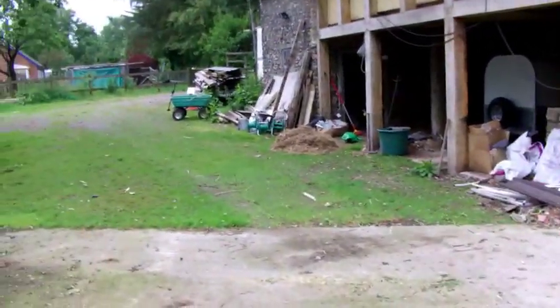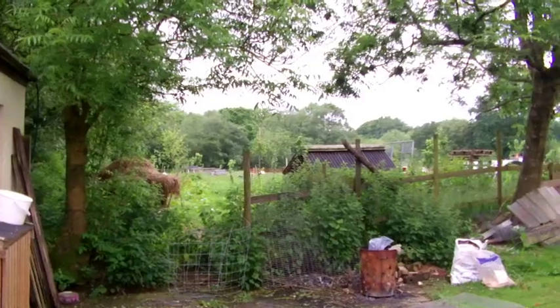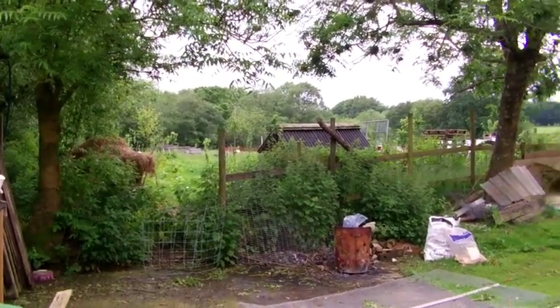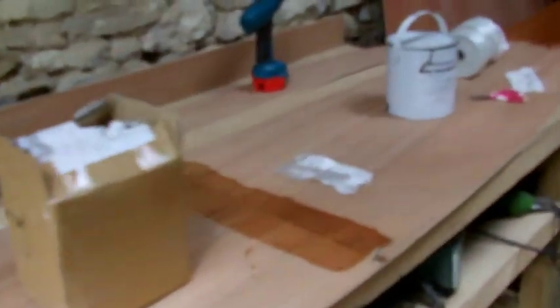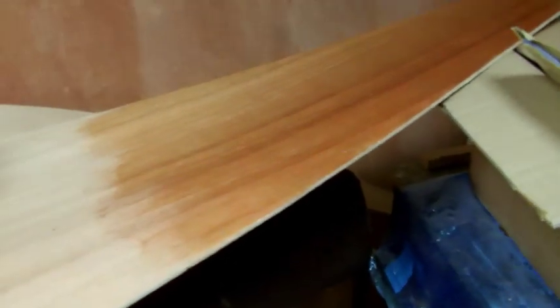It's quite a small workshop but nice, with a table saw, thicknesser, bandsaw, and mortise machine. I'll show a little video of the camp later — I'm camping in the wood for a few days to crack on with the build. If you have any leftover resin from taping, don't waste it — start resin-washing the actual panels with a nice thin coat. This is a cold mix so I want it to soak into the timber as much as possible.